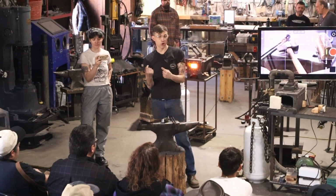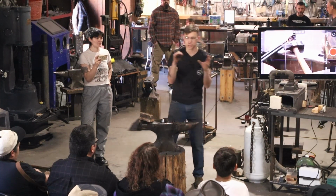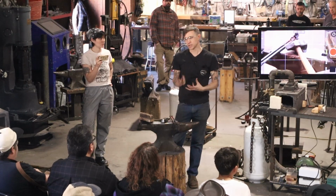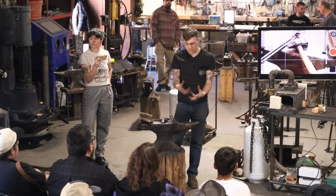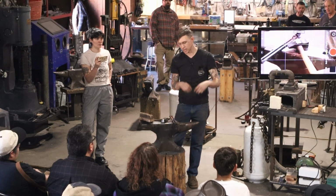I go ahead and put a notch in now for my handle. I want to establish and preload the steel in the areas. I'm not really doing knife design right now. The reason I like to do the point early is because it establishes a length that end is going to have. And for me, it's sometimes hard to guesstimate what's going to be correct unless I have that.